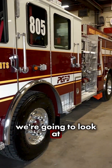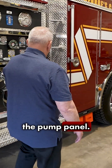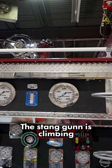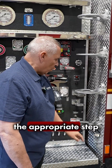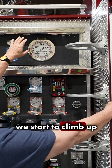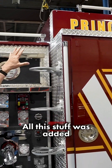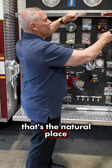The last set of handrails we're going to look at are down here towards the pump tail. As you climb up the side of the rig to get into the dunnage area, grab tools up top, or operate the stang gun, it can be pretty dangerous due to how steep it is. So we have the appropriate step heights but also grab handles everywhere as you climb up the side. There's one here, one at the top of the dunnage area, and another handrail at the very top. All this was added afterwards, once we climbed the rig and realized those are the natural places to put hands.